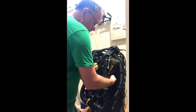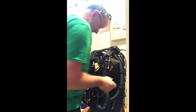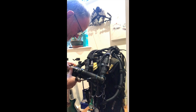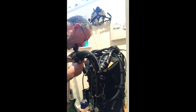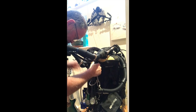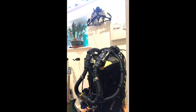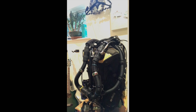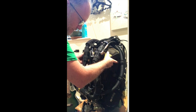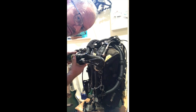Okay, first test on the unit — we do a positive check. I close the lung valves, close the auto dump free-flow protector, and blow up. That then gets left for five minutes. The positive test is done — plenty of pressure is still in there — and when I open it I'm waiting for a whoosh, which I get.